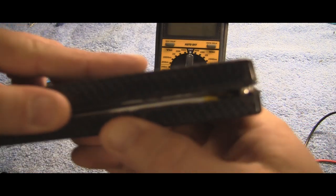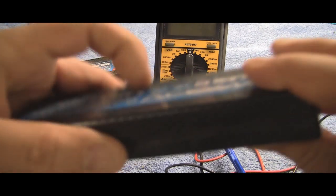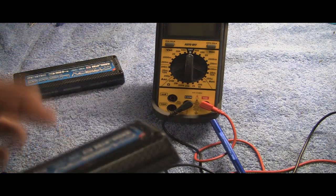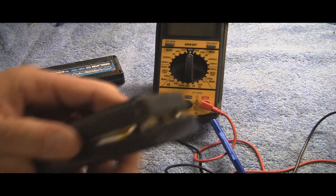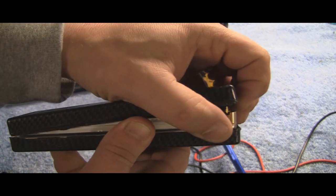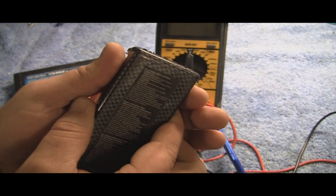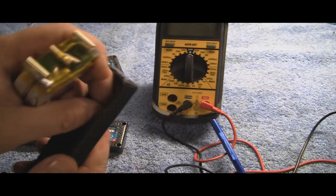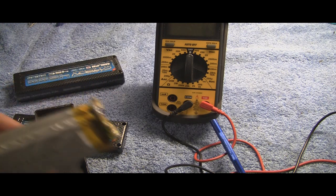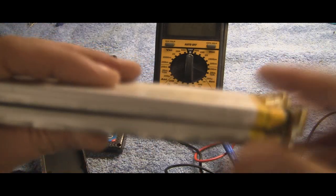As you can see this case — the sides have seen better days. Of course I haven't put it all back together yet. Once I put it back together it'll be fine. But you can see where it's been scored and scored and scored. So once you get that, it's not over yet because there's double-sided tape in these packs — it'll be real hard to separate. So you want to first take off probably the top; it's a little easier. Start peeling that back — this has already been peeled back. You can see where the double-sided tape is, really thin tape. So there's one pack, and then you'll have to do the same thing on the bottom. There you are — there's your actual battery. Two batteries, two cell. And again, they're soft, and you don't want to cut this pack at all.